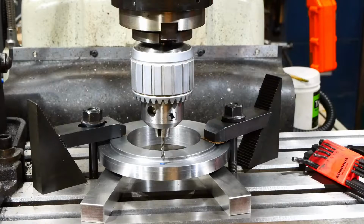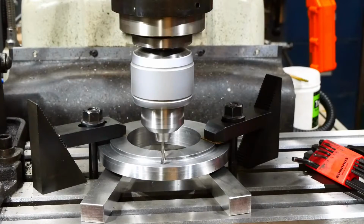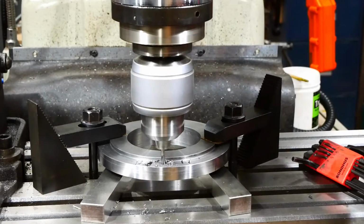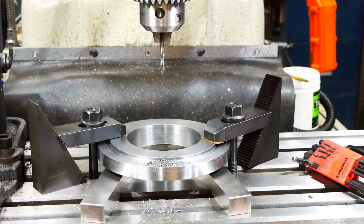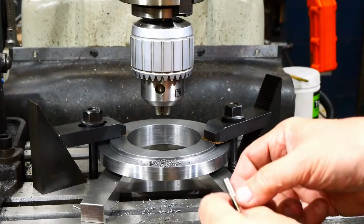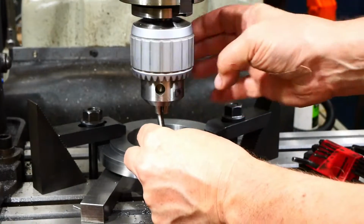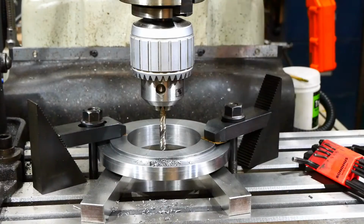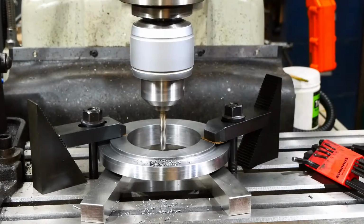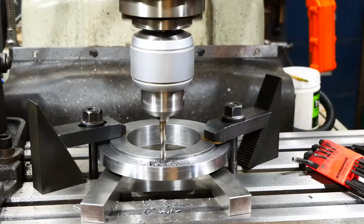Okay, so we're going to start with the stubby drill to get the hole started in the right spot. Alright, so we'll change out to the letter H drill, the correct size for tapping an M8. I use these stubby drills in the milling machine, as even though it's a big milling machine, you can still run out of vertical real estate. Okay, so we're going to slow that down a little bit now. It's about 800, something like that, probably.